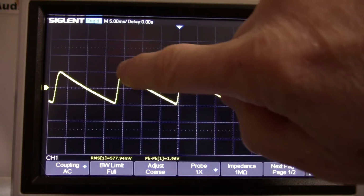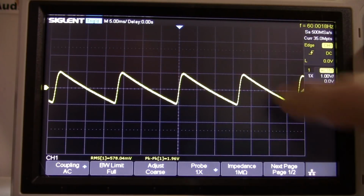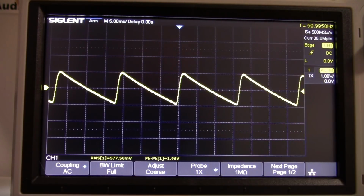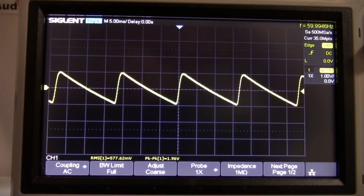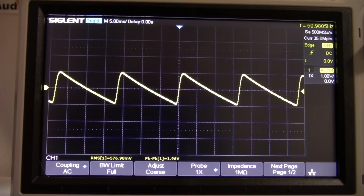And again, this has pretty sharp edges, so there are pretty high harmonics that could get into the amplifier. And in that sample, if you did turn up the volume and listen to the quiet part, you would hear a little bit of hum in the output there. But it's almost down into the noise floor.